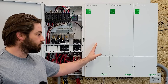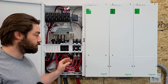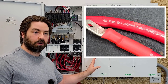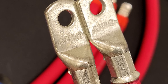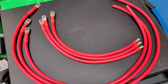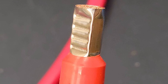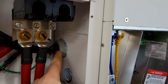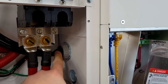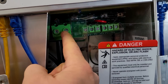Going from each charge controller to the negative bus bar and to the positive circuit breakers, we have two-gauge wire. Two-gauge wire is the largest wire that the terminals inside the charge controllers can accept. The two-gauge wire is all UL-listed, 600-volt rated wiring on the battery side — the 48-volt side. Back here you can see I have a 1¼-inch chase nipple with a bushing, and that's where all my big fat wires are going.